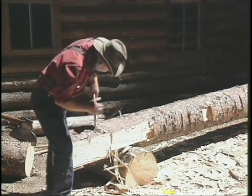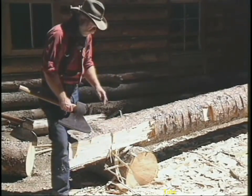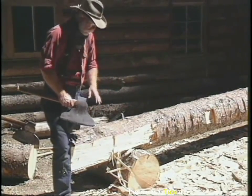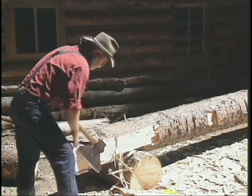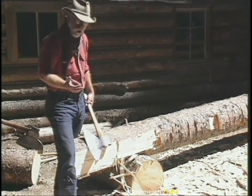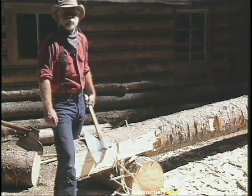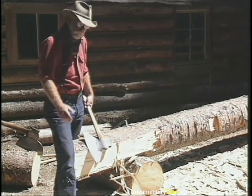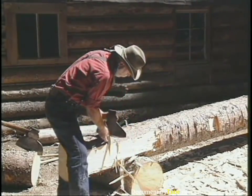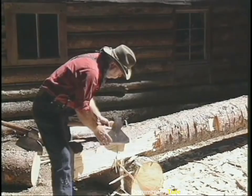When using the broad axe, if you miss — especially on these thin shavings — sometimes the axe will go on by. Let it go on by; don't let it go into the dirt and rocks. The wood chip buildup will save the edge. Don't try to pull a missed shot like that. These axes are heavy enough as they are — if you do it all day long your forearms will be burning, because it's mostly forearm work. If you get a chip stuck on the axe edge, stop and remove it, otherwise you'll get a glancing blow.